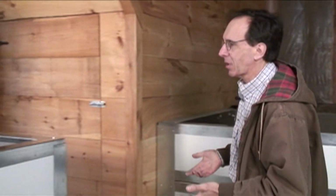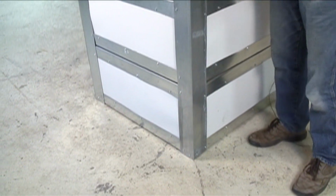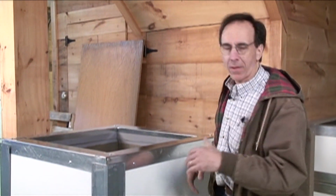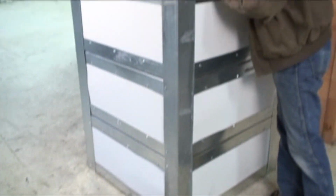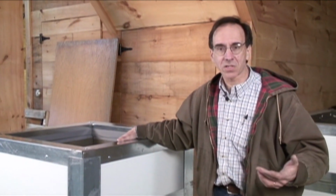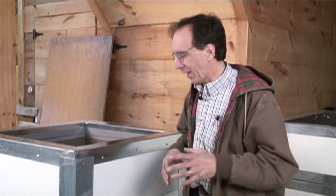This is a variation on the theme. This is a smaller tank that is only partially assembled. This is a 180-gallon tank. This would be more for a domestic hot water system than that would be. That would be really for space heating if you're doing solar, or would be for a wood boiler. This would be for just a solar system, a reasonable size solar system for domestic hot water, or maybe a very petite space heating application.